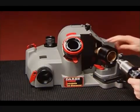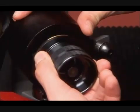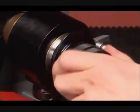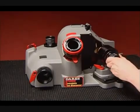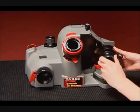Step 2: Sharpen. Turn the sharpening port so that the drill clears the wheel once it is in position in the port. Step 3: Insert the chuck with the thickest part of the cam touching the swing bearing. Release the port slowly. Rotate the chuck clockwise a full turn several times — repeat 6 to 10 times. It is important to keep consistent chuck pressure on the port. Let the cam dictate the natural in and out sharpening motion. Turn the port and remove the chuck.